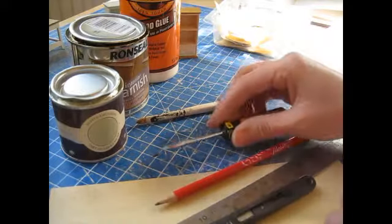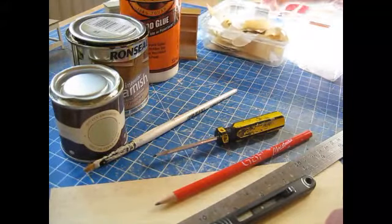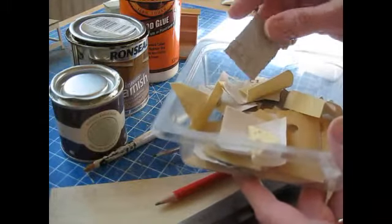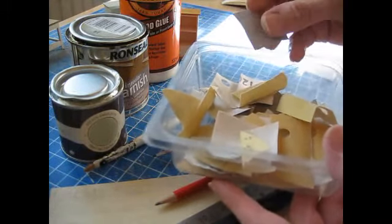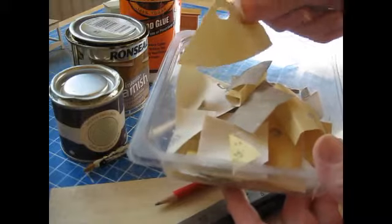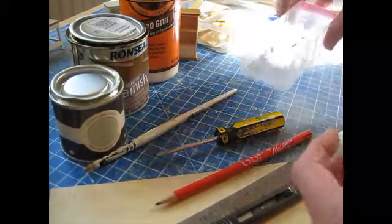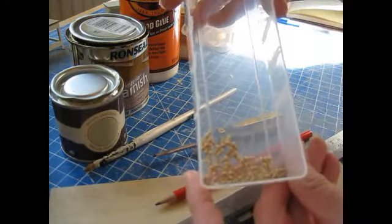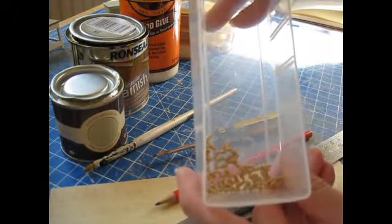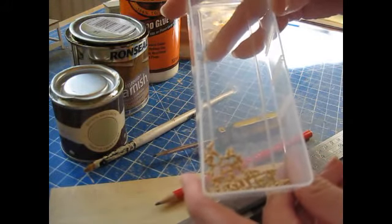To score the grooves in the back panel I use a flathead screwdriver along with a steel ruler. A paintbrush is obviously needed for finishing. I've used two grades of sandpaper cut into tiny pieces — a 120 grade medium and a 500 fine grade for finishing after painting. Finally, a drawer knob: I've used a 2.5mm wooden turned knob, available on my Etsy shop — I'll put the link below.